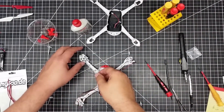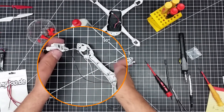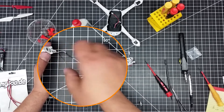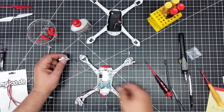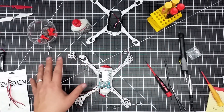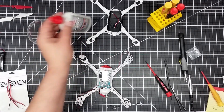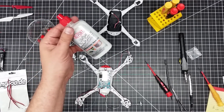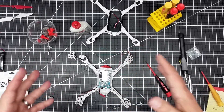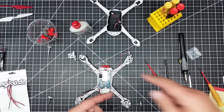I'm back. I soldered these in. One of the things I did is I only put heat shrink tubing on one of the leads, because the arms and everything are plastic and I didn't want to bunch it up - there's not a lot of room in here, so I left the other one bare. There's nothing for it to short out against since this is plastic, just to save on room. Now I'm going to go ahead and reassemble the gears, lube it with this Teflon Nonstick Dry Film Lubricant, and when I get it put back together I'll show you how I lubed one.